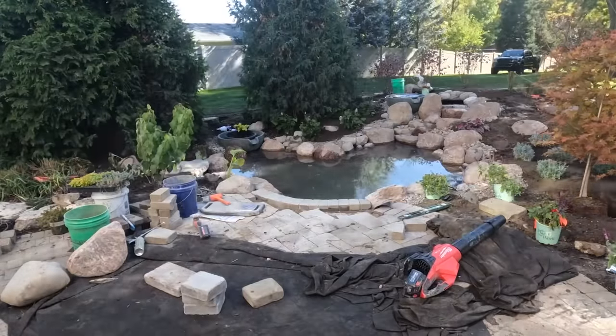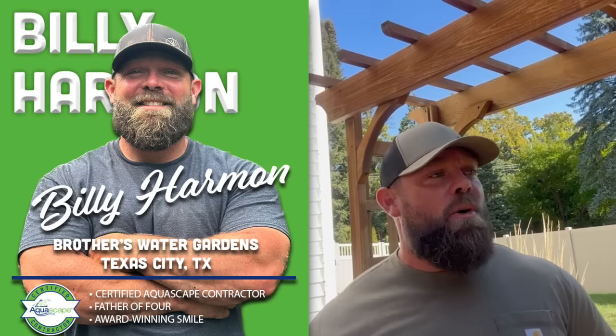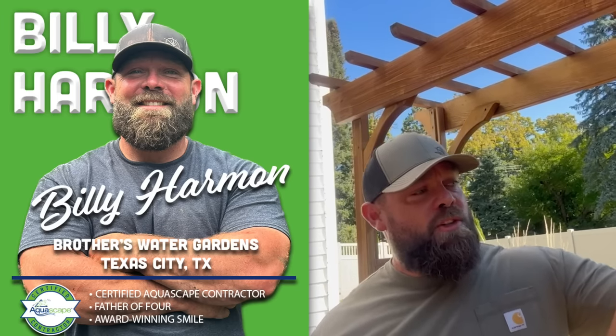Billy, give a rundown of everything we have going on out here. Basically we have an 11 by 14 foot footprint, we took a bite out of this patio, I did a formal wall at an 18 inch depth, nice little cascading waterfall. We have two fire bowls - we converted one of them into a little planter and then the other one up at the top actually has fire going. The bio falls is in the back, the pump is a 4-7, we have color changing lights in this feature. Wish we were here at nighttime to see what it looks like, but it turned out awesome.